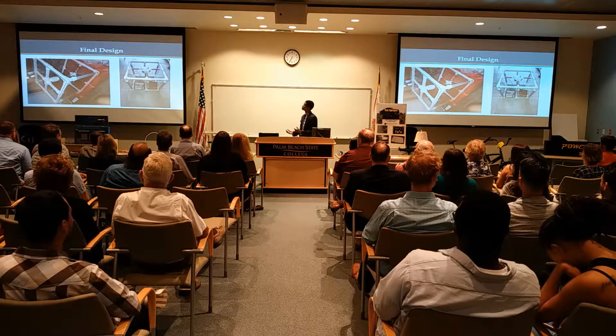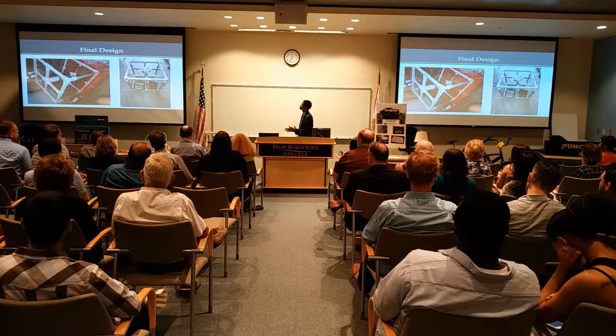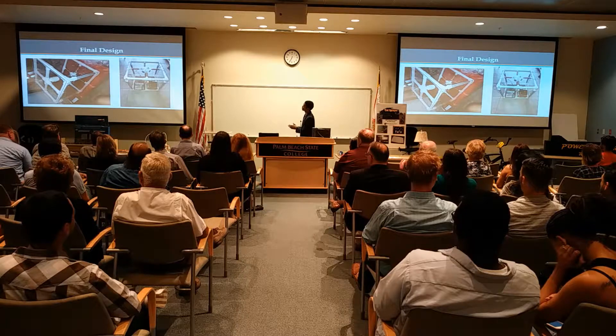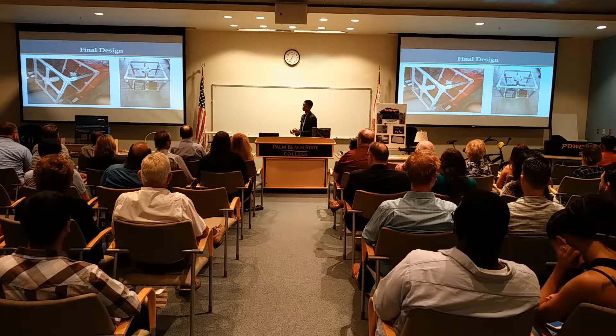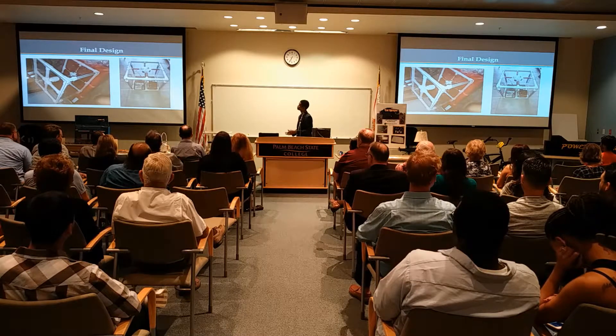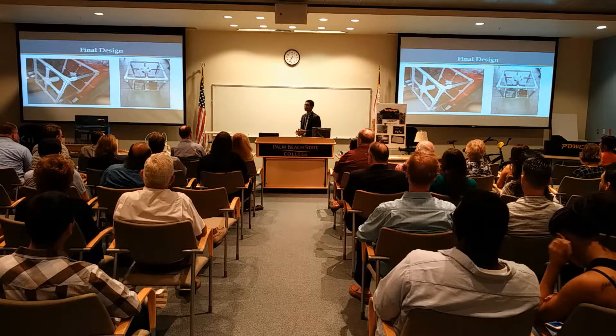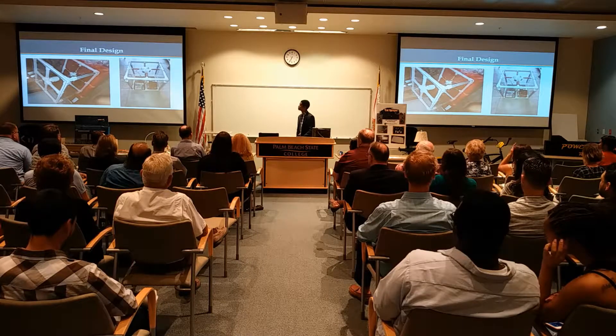Here I am showing this plane almost when my project was nearing its completion stage, here on the image to your right. As you can see, it's a single-phase induction-type motor. I did 600 turns, and each set of poles took quite some time. Each pole had to be in the opposite direction, and this was really important because it ensured that whenever there was current, the electromagnets would alternate.